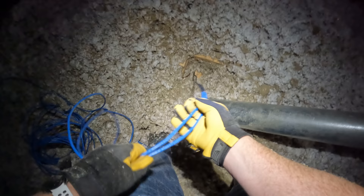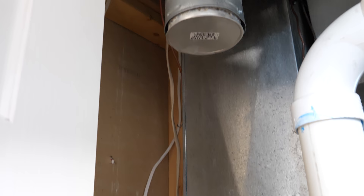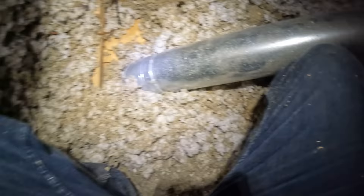I'm actually going to take two cables, put them together, and kind of splice them with this coaxial cable, electrical tape them up, and then they'll be ready to pull through. Give it a pull. Let me know when you see blue. So here in the network room, my wife actually found the cable I was pulling on right here, and all she had to do was pull it down. The cables came right out here. I did a little bit of rearranging and moved the network cables up, and you can see they come down right over here. So I just need to add some RJ45 data plugs to them and then I can plug them right here into our switch. Once that is complete, I should have 1000 megabits per second up in the new office.